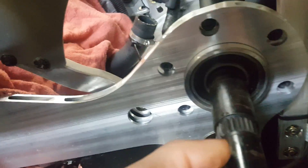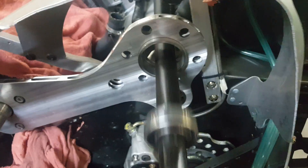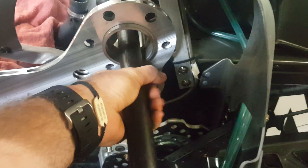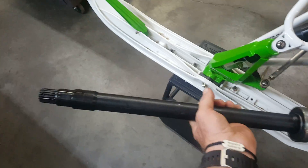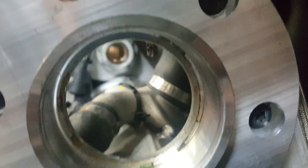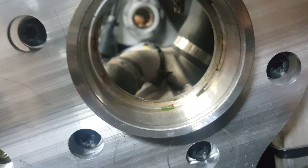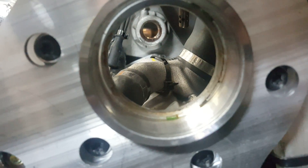Once it's hot enough, just grab it with your hand and pull it right out. There you go — you have it in your hand. You'll see green Loctite in this cavity here. You want to scrape all that green Loctite out and reapply either red or green Loctite to put your new shaft back in.